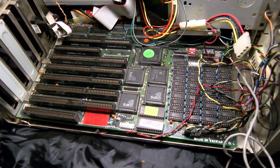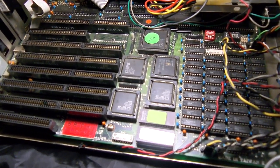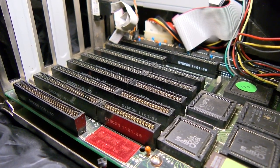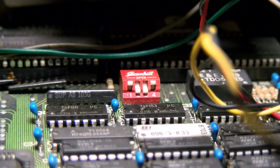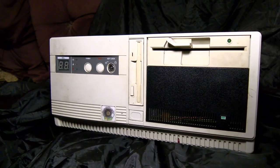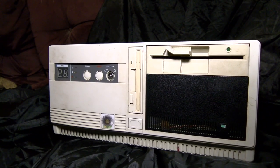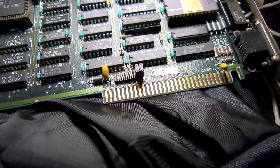Sometimes it's not that simple though. At the lower end of the problem scale there are machines like my slower 286 that can't use most VGA cards. In this case, whilst the system does have 16-bit ISA slots — which was new to the 286 — some systems don't like mixing 8 and 16-bit cards, and they don't tend to expect video cards that didn't exist yet. This particular machine doesn't even know what VGA is; the BIOS barely supports EGA and its implementation is already a little dodgy, it being brand new technology when this motherboard was produced.